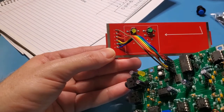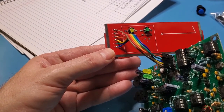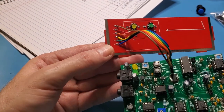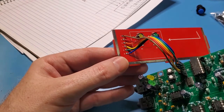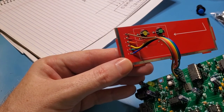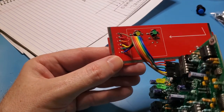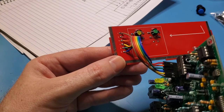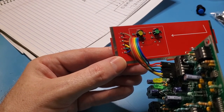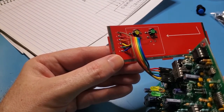And the manual does have which pin goes to where. It's not a simple straight through mapping here. So just refer to the manual, but if you're going by the colors here, so if you look at the panel colors, blue, green, yellow, orange, red, brown, on the phaser going from inside to out is brown, yellow, blue, green, orange, red. So there's those 2 arrangements right there.